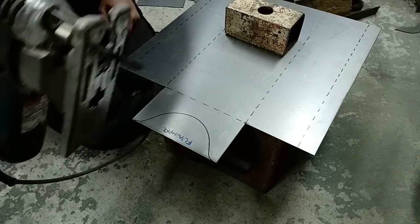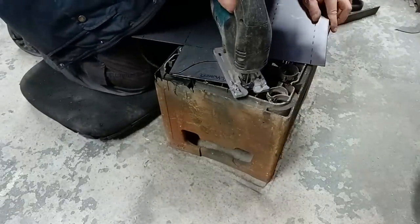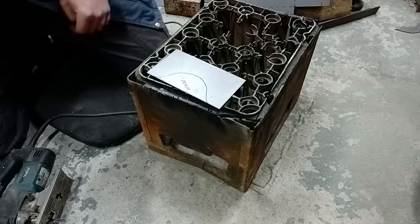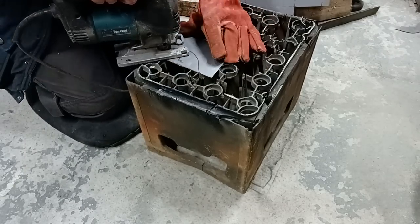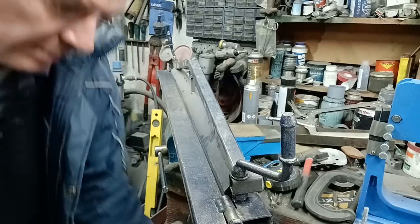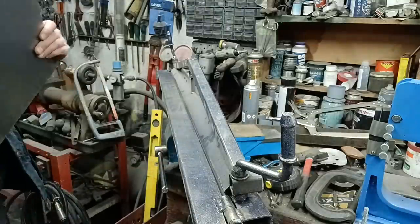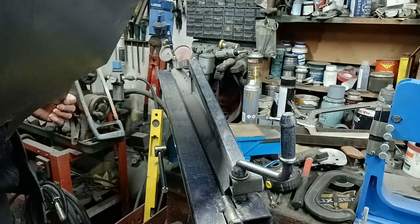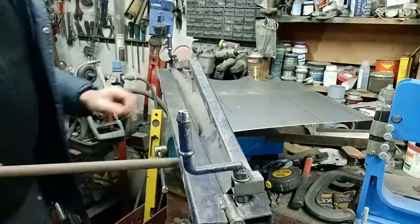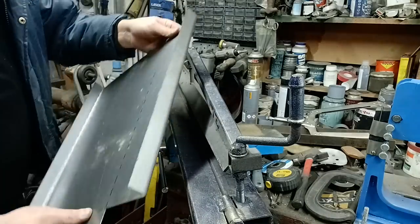Right, as usual, a standard bit, a little bit on a jigsaw works a treat for this. This doesn't have to be quite so easy because I've got a very little hole to hang on to it with, because I cut it off. Lovely. Now we've got those cut out, it's time to use our benders to bend these to shape. So we'll make sure we're doing the right way around for a start. Should be good. Right, so that's our first two bends then.